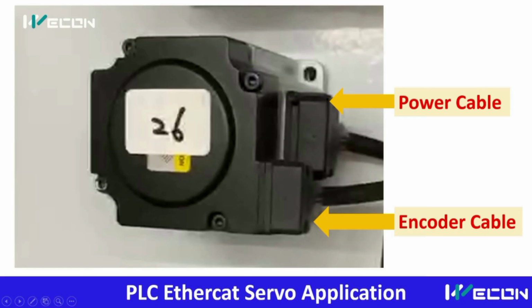Now we will see the connection to the motor side. Yes, I have asked you what are these two connections. So first, this is the power cable for the servo drive and this is the encoder connector, because nowadays most servo motors have inbuilt encoders. So this is how the servo motor and servo drives are connected.